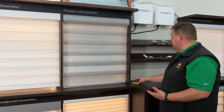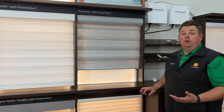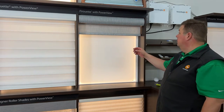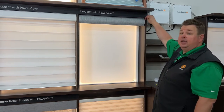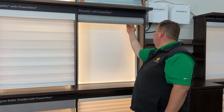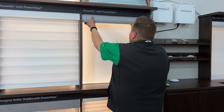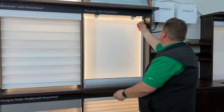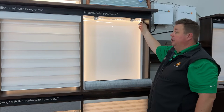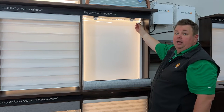And we do this by — I'm going to raise the shade up here — what happens is we have an electrician wire up your house with 16-2 wire to the window, and we always go in from the right side of the shade, one inch in, one inch from the back, and hook up connectors. I'm actually going to disconnect and take down this shade.